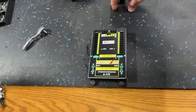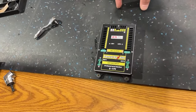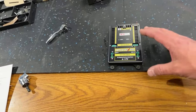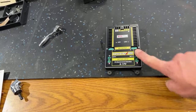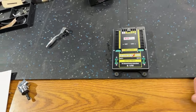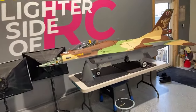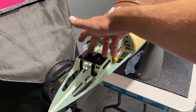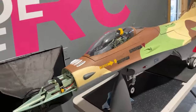And then our back central box, which is still gonna be the 210, that's gonna be fed from the BEC outputs. So we're gonna have a constant 8.4 volts. That's really one of the only benefits to having the 400 is the BEC outputs. The 300 series is awesome. And the 300 series is basically exactly what we're using in the F-16, right? So same thing here, we've got two 3-cell LiPos going in here, and we've got a regulated 8.4 voltage all the time.